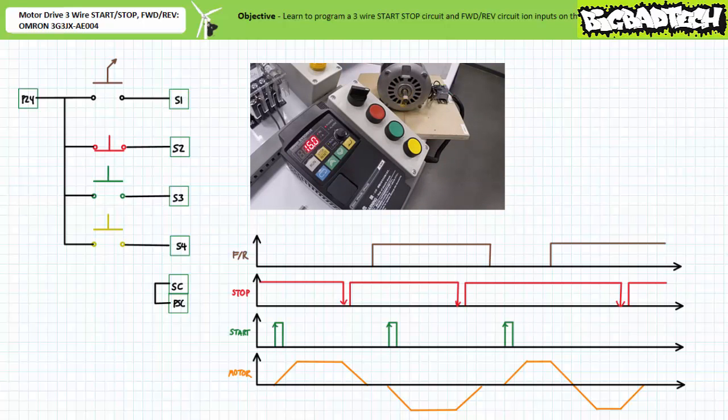When the selector switch is toggled into the activated closed position, reverse mode is asserted as expected. When an operator presses and releases the start button on input three, the motor drive increases applied voltage and excitation frequency. The three-wire start function maintains the last asserted state and continues to operate in constant speed mode — only this time in reverse. When an operator presses and releases stop on input two, the motor drive decreases applied voltage and excitation frequency, and the motor decelerates and turns off.